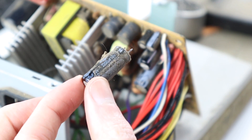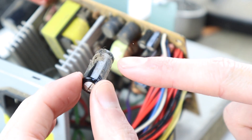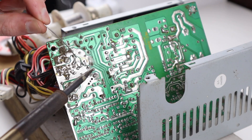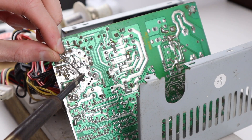With the capacitor removed, we can see this one is 2200 microfarads at 10 volts. The white stripe on the side indicates where the ground pin is on the capacitor, so you don't put it in backwards and blow it up, as these electrolytic capacitors only go in one direction.